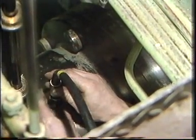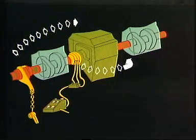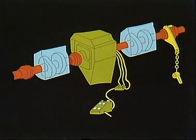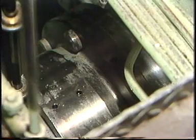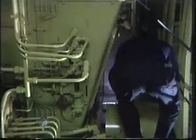Disconnect the hydraulic tool and move it to the coupling flange on the other side of the chain transmission. Also, move the camshaft turning tool and block and tackle. Repeat the procedure. After the camshafts have been adjusted and the hydraulic tool disconnected, wait at least 15 minutes before refitting the plug screws into the flanges again. Remount the protective guards.